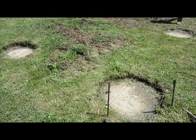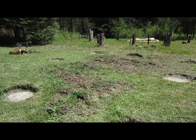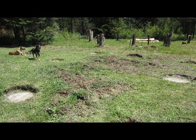It's hard to tell because he's letting it shake. It is hard to do, but we're within about a 16th to an 1/8 of being square. So I'm happy with that for the greenhouse. Now, like I said, if I was building the house, I wouldn't be happy with that. I'd want it within like at least a 32nd to a 16th. I'm just picky that way, but some guys, till you get to the top level of your house or whatever, you're going to be off quarter, half, 3/4 of an inch.